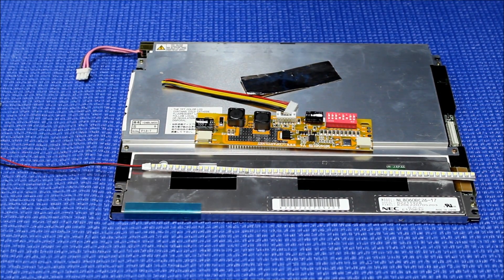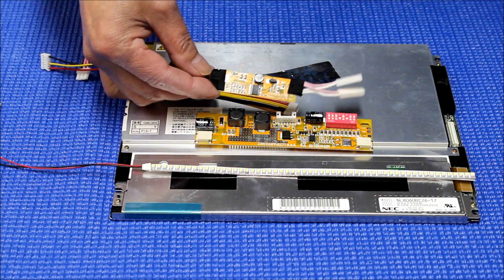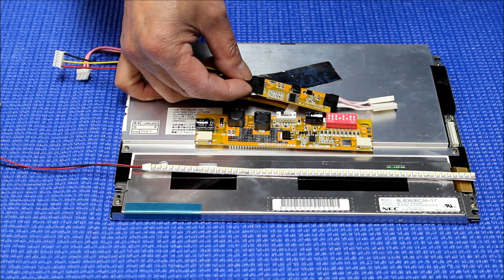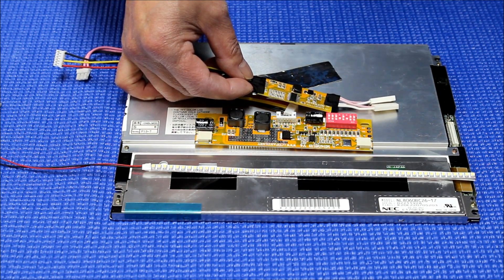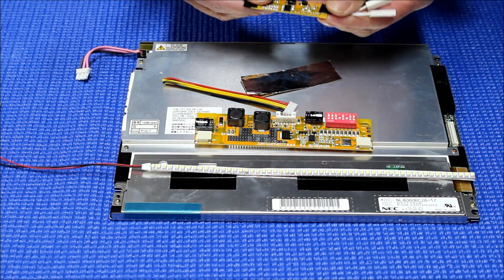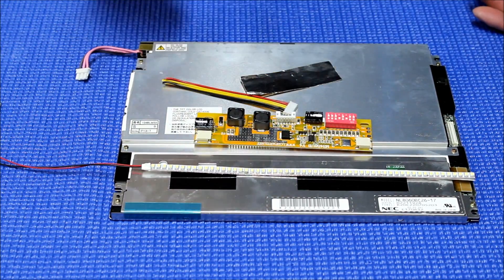If your application space is kind of tight on your machinery or chassis, you can also request us to get this much smaller driver, called MS492 LED driver. This one is also compatible with the strip too. But I highly recommend using the MS456 unless you really need a smaller one — the smaller one is also available.